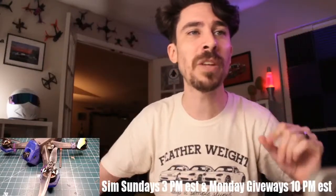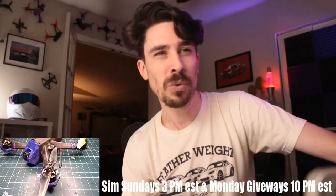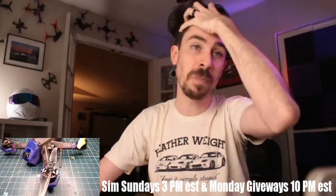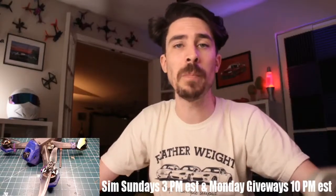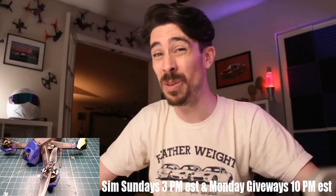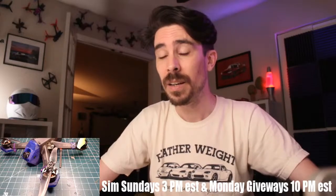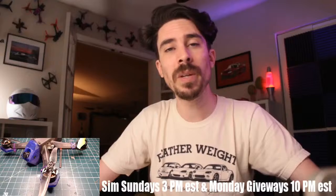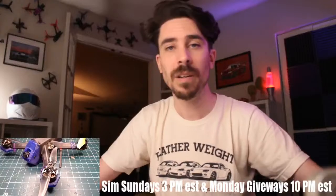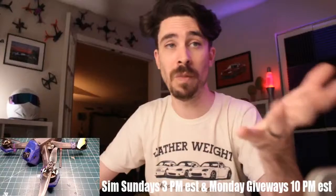It's Driesel says, got a 20x20 Hobbywing X Rotor 40 amp and Revolt OSD. Think it'll fit in the Tiny Trainer build? Well, the problem is going to be the Revolt, because they put all those goddamn connectors all over it. I can all but guarantee you that that's not going to fit. I hope they don't get mad, I don't know if this is public info or not, but they are making a carbon fiber top plate for the Tiny Trainer, and that will allow you to run taller standoffs. So that would be an option for you.